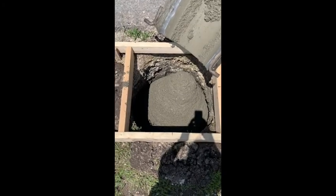One quick point that you maybe can't see very well in the video is that the forms are a little higher than the playing surface beyond, about a half inch, and it's best to pour the concrete at least even, and maybe a bit higher than your court.